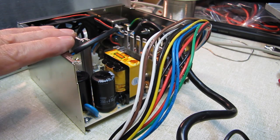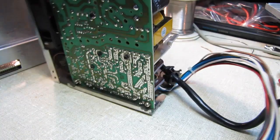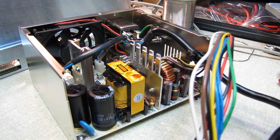That's all there is to taking it apart and getting in there. I'm not going to show you me putting it back together — it's bone simple, you know, a dozen screws. This is out in your hand, replace those two caps, put everything back together and you're back in business. Don't forget to solder your fan wires back in. That's it — I'm the radio mechanic. Hope somebody out there with one of these waveform generators, the model 395, finds this useful. Maybe it'll save you. Take care, I'm out of here.